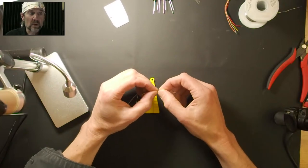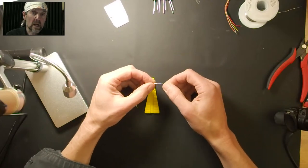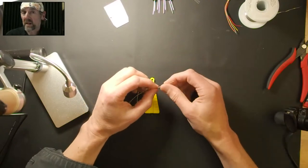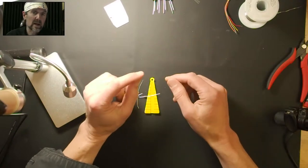In a mic that's used at room temperature, that's probably not going to matter that much, but it's nice to have. They're 1% tolerance, which is great. So you don't need to go to special lengths to match them. They tend to be matched anyway in situations where you would need to match. Now, this mic does not need any kind of matched resistors.